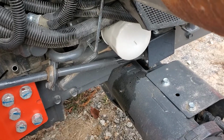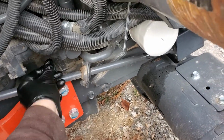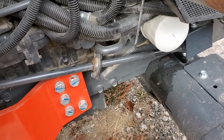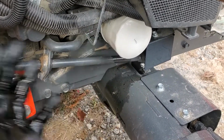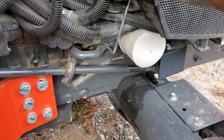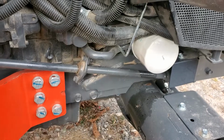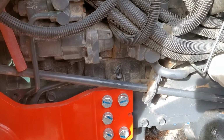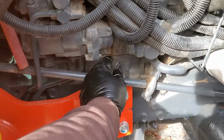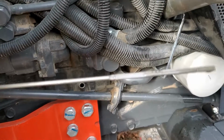Thing is, we haven't ran this yet, so I'm going to go ahead and start this up, let some things circulate for a little bit, make sure that we've got oil in the filter and everything's really started to flow. We'll let it settle, let everything kind of smooth out, sink back down off the parts, and then we'll recheck the fluid level. All right, I've already wiped it off once. Let's pull it out again after the drain, and let's see where we're at.